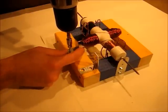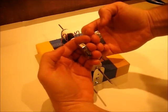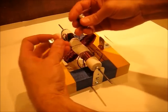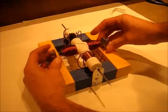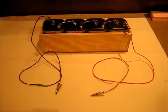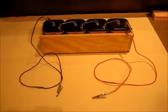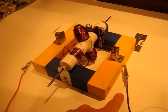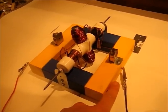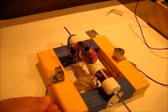Screw in your homemade or bought angle brackets on the sides. Make sure your magnets are pulling towards each other, and put them on both sides on the angle brackets. For a power source, I'm using four six-volt lantern batteries tied together for a total of 24 volts. Hook your negative battery terminal on one side, your positive on the other, and let it rip.